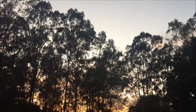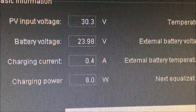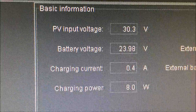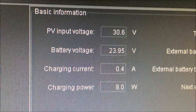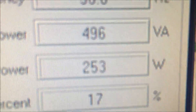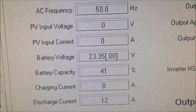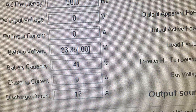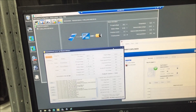Good morning YouTube, it's 4:45 a.m. The sun's coming up now — 4:55 in the morning. My batteries are nice and flat, but it's charging at 8 watts — not bad for 1700 watts of panels on that inverter, 6000 watts on that one. Under load I'm drawing 252-253 watts of power off-grid, and the battery voltage under load is 23.35 volts.